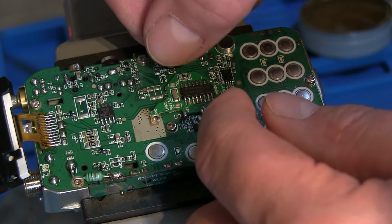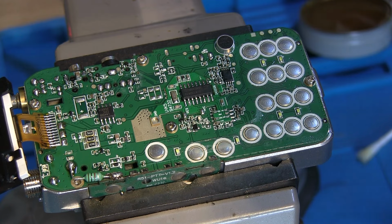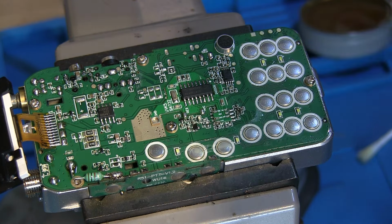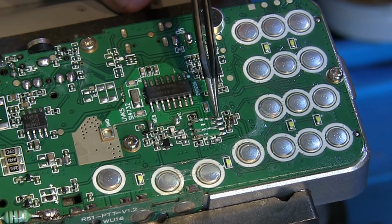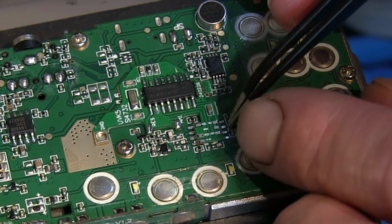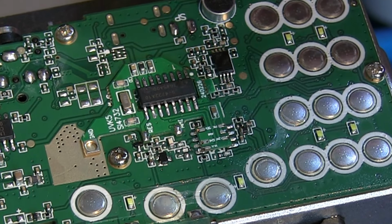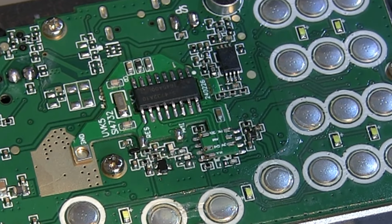And I think, watching Paul's video, how he did it, he stuck that on with some double-sided tape. Now the kit doesn't come with any, so I'll probably do the same. I'll cut myself a little bit of double-sided tape. And then I'm just going to try and use solder paste, I think, just to solder those. Looks like there's six pins on there. So there's one here that misses, one, two, three, four, five, six pins just there. Again, you can't see it, but there are actually some very tiny minute holes through the board itself. So I'm hoping that once we've stuck that on, we can use the solder paste to heat that up and let that dribble through. Then we need to make these tiny little jumper wires up. I have no idea how we're going to do that just yet, but watch this space.